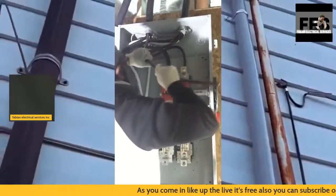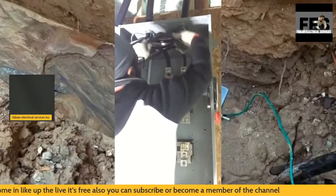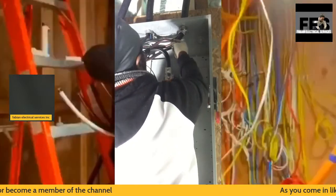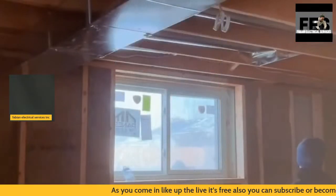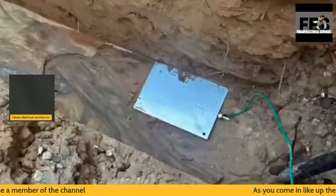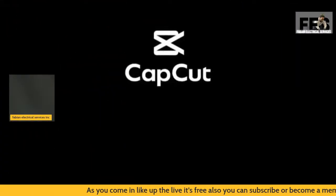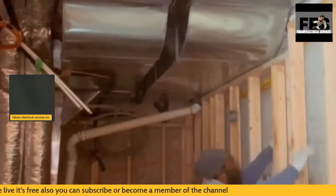And the two sets of cables you're seeing, those are the 250 kcmil wire installation. I've got lines coming in on parallel feeds, and I've got lines going up on parallel feeds, all with the same length. So that was a short video of the 400 amp installation. I'm now going to pull up another video of the actual 400 amp panel installation.